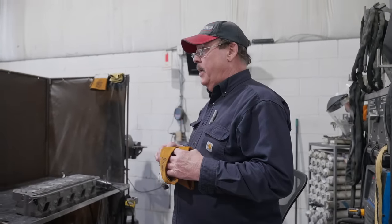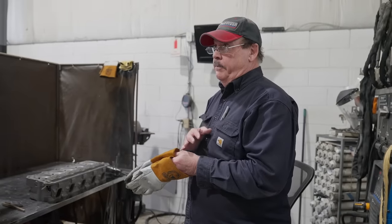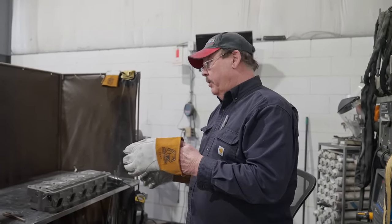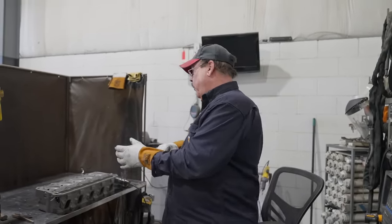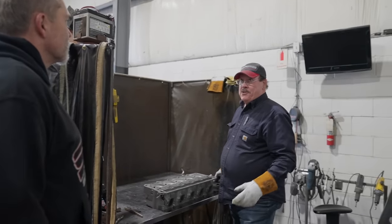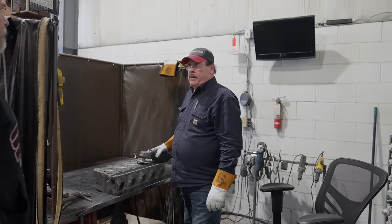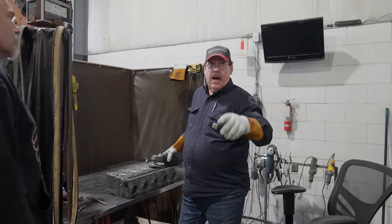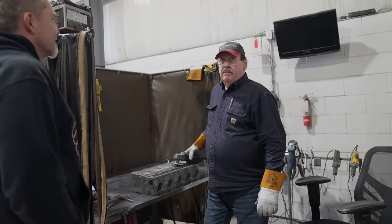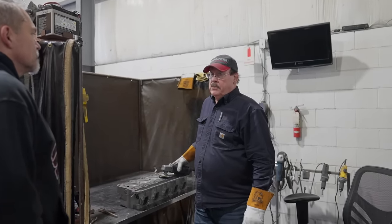You might want to try to upgrade your shielding gas to maybe a little bit of helium in it, at least 25% or 50-50. On heavier aluminum, it'll make a big difference for you. It's hard to get the helium. There's been an international shortage for years. Unless you have a contract for buying it, you can't get it. And these cylinders, those aqua color ones, are $625 a piece, and I can burn two a day. It's really affected the cost.